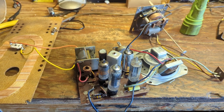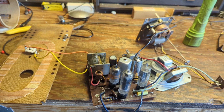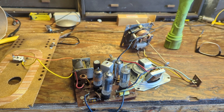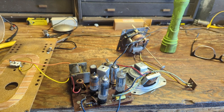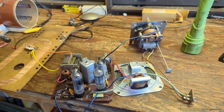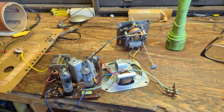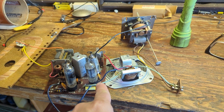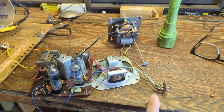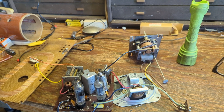Welcome back, day three working on the Admiral — and I have a confession to make. I didn't film any of it, which is a shame because about three wires came loose. I make as many mistakes as everyone else does, but I could not figure out why I wasn't getting any power. I was looking at the schematic assuming I was doing it right. Long story short, there was a brown wire coming off and I figured the brown wire should join the other brown wire — color-coded, right? I connected it up and — boom — huge cloud of smoke and it tripped my circuit breaker.